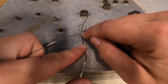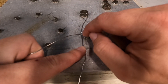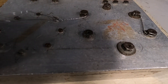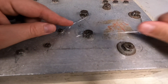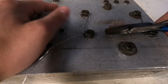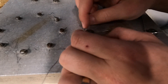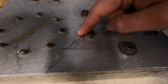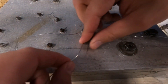This whole thing is about one wrap too long. If I pulled this through this bolt, this wire would be really loose right here and I want it nice and taut. So I'm going to take one wrap of wire out - the AC43.13 tells me I can do that. Then I'm going to take the piece of wire that's coming from the top and go into the bolt. You grab it with your duck bill pliers and just sort of pull it into the bolt - you don't want to go clamping down like crazy. Now when I say it's the bolt that's coming over the top, I mean this wire right here is finishing at the top of the twist - that's the wire you want going through. Then I'll take the other one and go through the next castellation, because we're using the cross method.